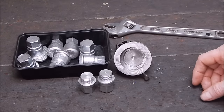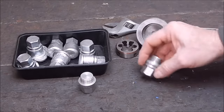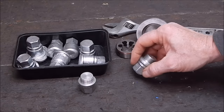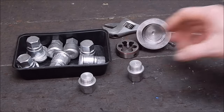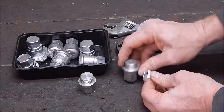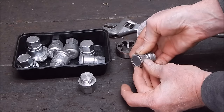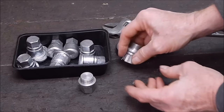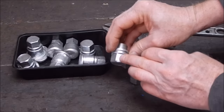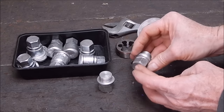So where are we at now. When I did this job you have to grip the aluminium without marking it. I did that by putting some aluminium strip around it - just cut some strip, put it around the jaws and faces, and that goes into the three jaw chuck. It gripped OK and avoided marking it. This one here has been marked because the aluminium got used a bit too many times and broke. But if you use new aluminium that will protect the metal.